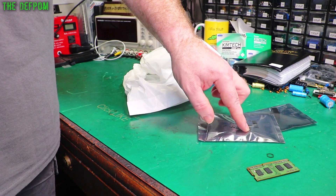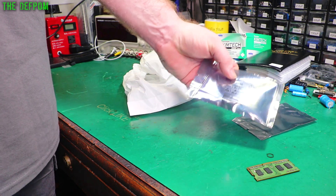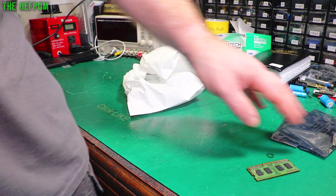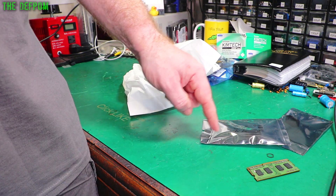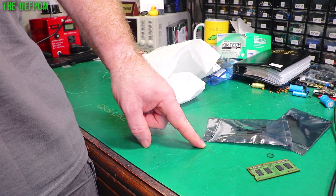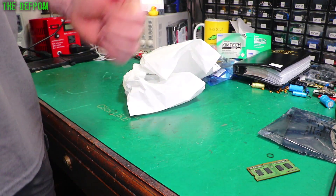I'm hoping I can just pop these ones in, but they might not be the right footprint. If it's not the right one then I'll have to try and source the 14-pin version. What I did notice though is that these op amps are actually inside the Datron 4700 calibrator I just fixed. It's got a mixture - some of the 14-pin ones and also some 8-pin ones. So at the very least I've got some spare parts for the Datron in case they ever fail.